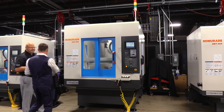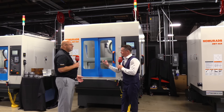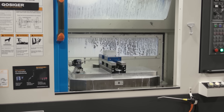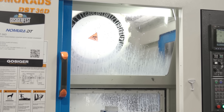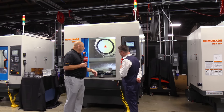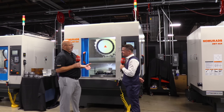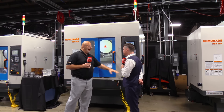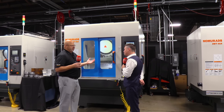The first machine we were cutting a piece of steel. Now it looks like we have some sort of pallet pool here that's going to rotate in and out — a style of automation. This machine is what I would call a simple form of automation — it's inside the machine, designed into the machine. What it allows us to do is open the door and load and unload parts while it's machining behind, so we maximize spindle utilization by minimizing downtime. Once we're done, we close the door, hit pallet ready, and in four and a half seconds we're back into the cut.